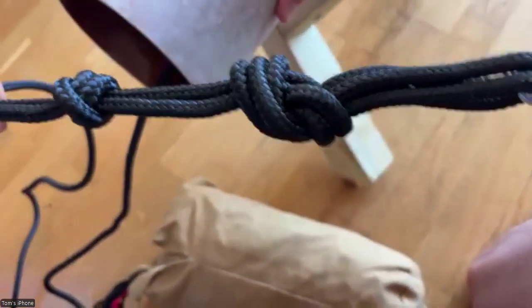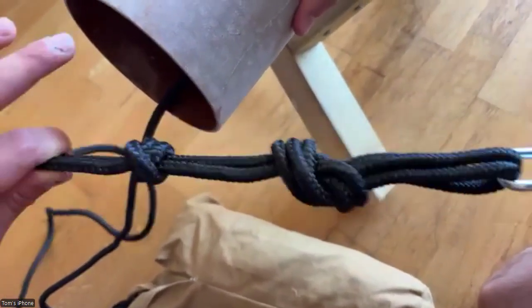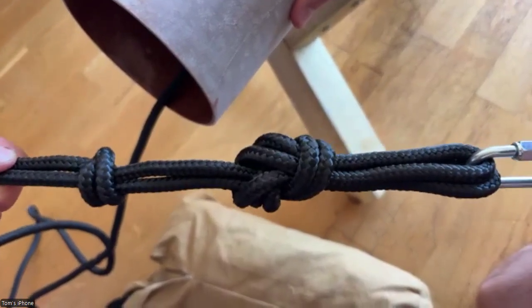Okay, so I see you've got it basically bolted into the top bulkhead, the aluminum bulkhead with your charge wells. And did you sew the ends of that shock cord where it's hooked into your swivel link, or is it just knotted? We have a double knot here, so that's our swivel here. Is it a figure eight? Yep. And then a stoppage knot as well.